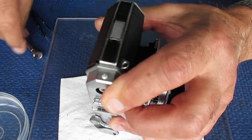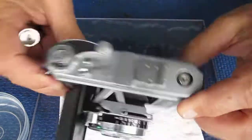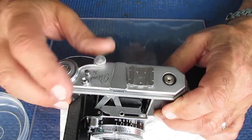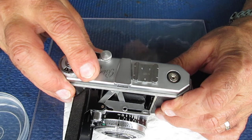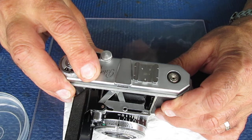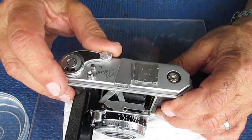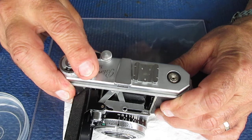All that remains after that is to assemble the rewind. If you listen to that click as I press the release down slowly, you hear a very slight click, then a heavier click. Now that's released the film advance. At that point I wind again without having actually fired the shutter — which means the adjustment's not quite right.